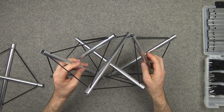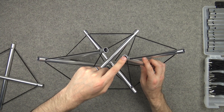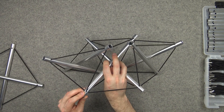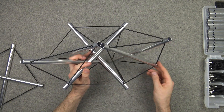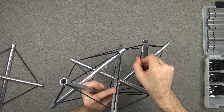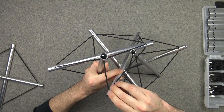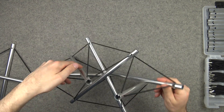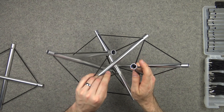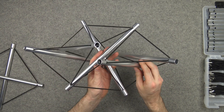This one wants to rotate. Why is that? What's the difference between these two? This one is joined there, and that means the corresponding joint would be from here to here, and then it'll stabilize this one in rotation. If we grab the middle one, you can see that this one's stable. This one wants to rotate and has a vacant hole here. So let's join this one here and this one here. Now the whole thing is stable.